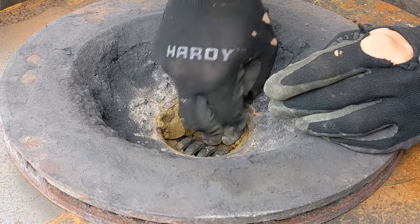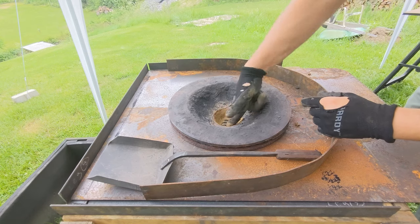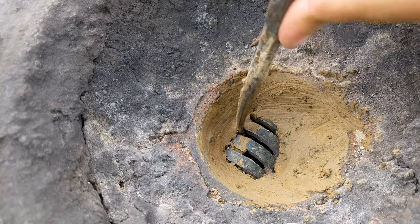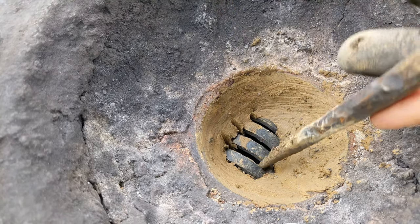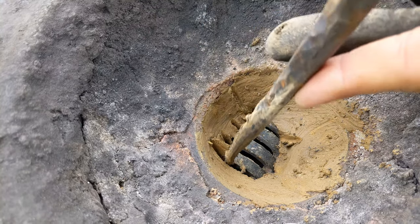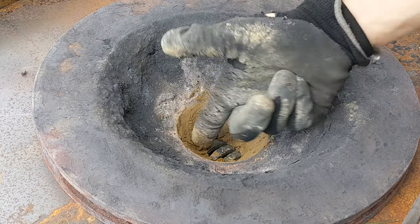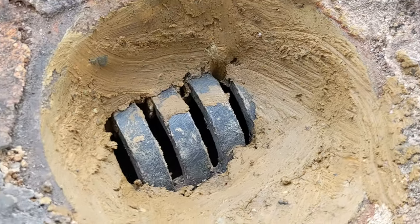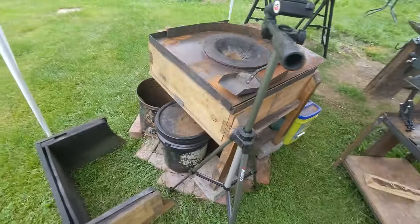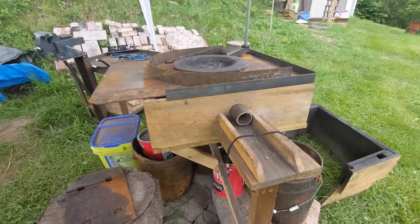Basically every time I intend to fire up the coal forge, I clean it out of all the clinkers and any bits of clay or other non-coal items festering down there. I forged an ash clean-out rod. Since the air pipe is horizontal, there's really no place for the ashes to go except form a little pile under those slots. So every time I go to forge something, I use the ash clean-out rod from the side hole and pull it all out. It seems to work pretty well and it's never clogged up on me in one entire forging session.